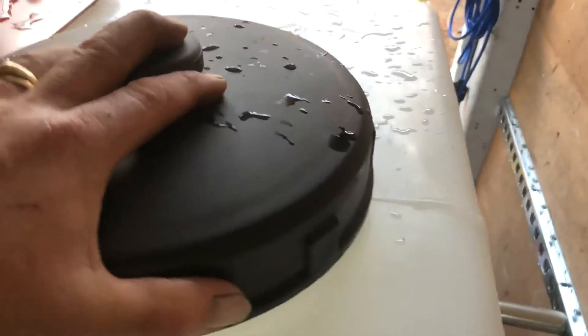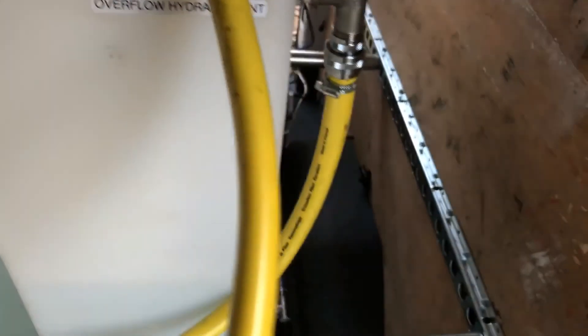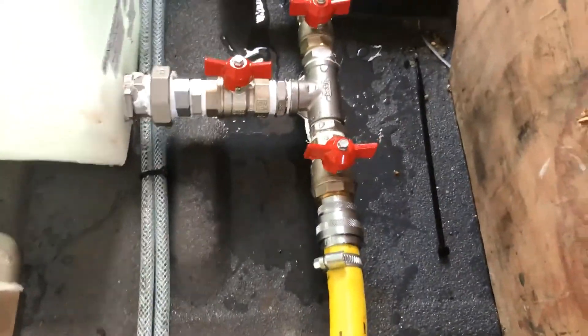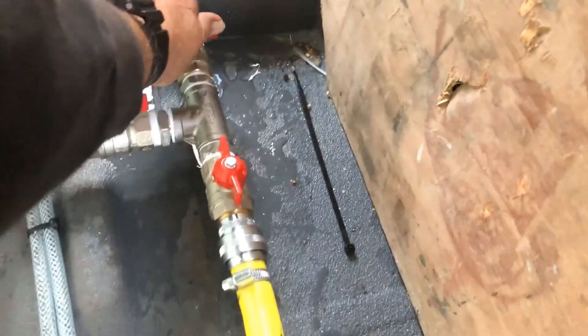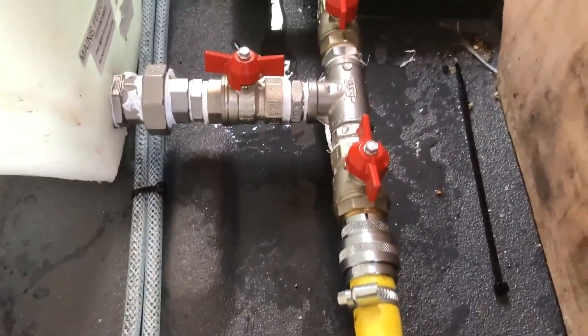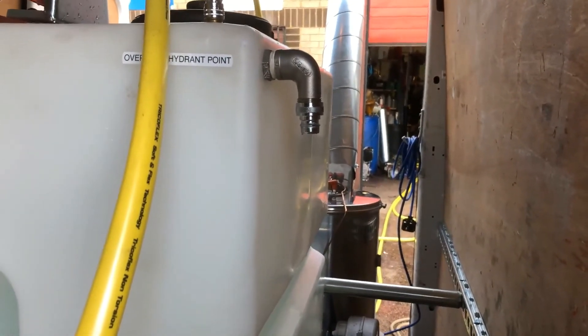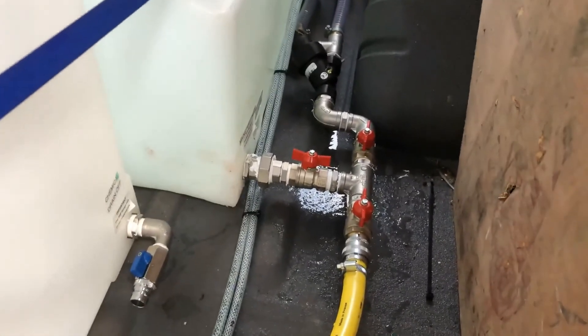Make sure that you take the lid off — loosen the lid off a touch — because hydrant points fast flow, it will soon fill that system up. So if you're working at the bottom set up, what we're simply doing here is force feeding it from the customer's mains. You would click into that point at the bottom, have both of that open, that one open, and that system open there. That would then give us mains water, it would fill the tank up when it's not being used, and you'd also have your overflow point on that side that it would come out of. So it overflows, it comes out on a pallet point down out of here on a pipe, so it's protected from overflowing — not going all over your van. That gives us no restrictions in the system.